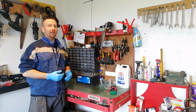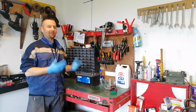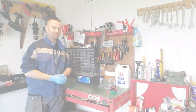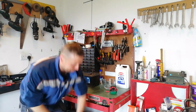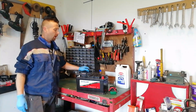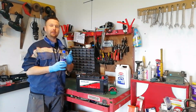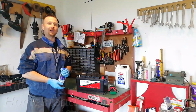It's time to come clean and explain how they did it. Dissolving salt in water creates an electrolyte solution. Putting that electrolyte solution into the battery creates a false reading — if I put two probes of the multimeter into this jug of Epsom salt solution, I'll get a voltage reading, but that doesn't mean there's any actual power present. So does it work? Absolutely not — it's a complete and utter scam. Don't waste your time; just go buy yourself a new battery and take the old one to the scrapyard. Incidentally, don't put vinegar anywhere near the inside of a battery — vinegar is acetic acid, and when you mix acetic acid with sulfuric acid it creates peracetic acid, which is explosive when moderately heated. So don't do it. Thank you very much for watching — I'll see you next time.